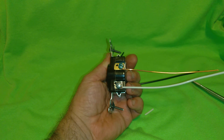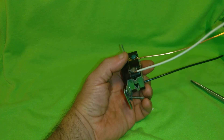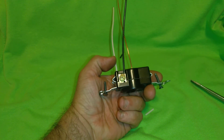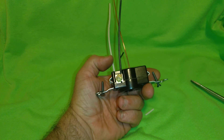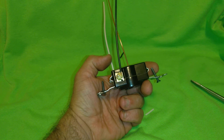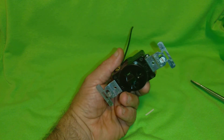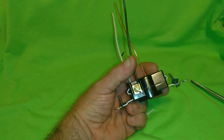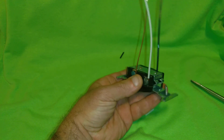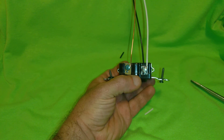It should look like that. Here in the country I'm born in, we use 120 volts for most appliances, and we have 240 volts for large appliances like your air conditioner, electric dryer, stove, and water heater. This is a 120 volt single outlet — we use 12 gauge on 20 amps and 14 gauge on 15 amps. You make your connections the same with both wire sizes.